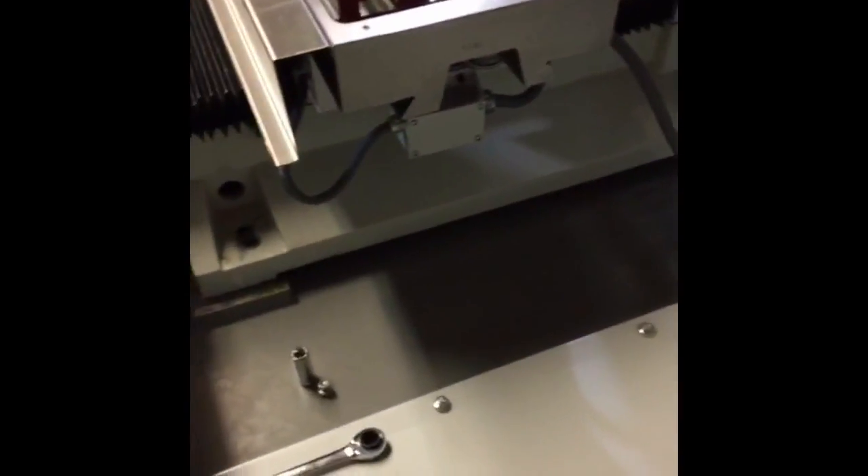But when you get over to this side of the machine, things get a little darker. Down in here you've got the end of the control panel to deal with. This space is just wide enough to fit your hand down in there, and you've got two bolts there, then further down you've got one more. You've got to try and get it in there and get it all lined up. The problem is when you're in this location where you have to tighten them down, you can't see them, so you can't tell whether you've got good alignment or anything. It's a real pain — I spent about two hours just trying to get that square.